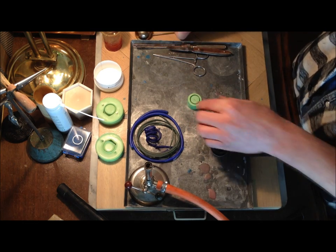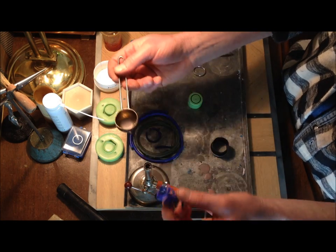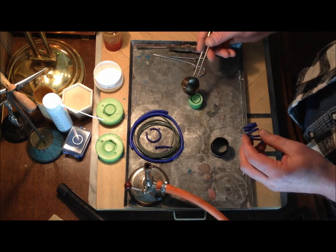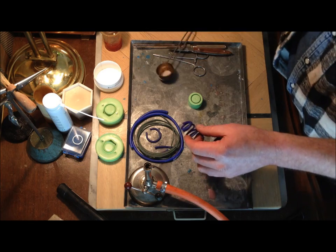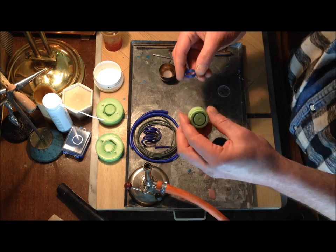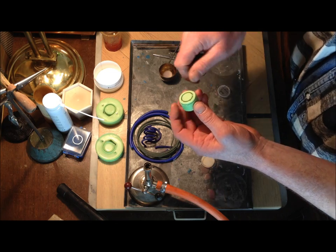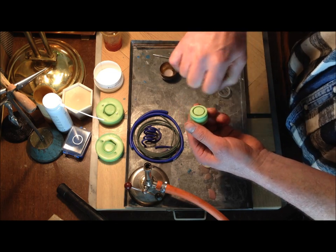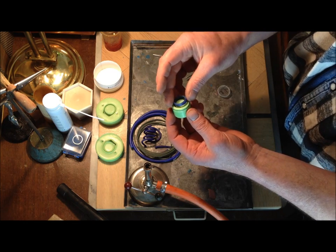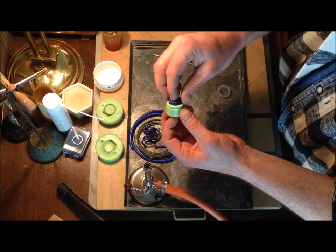At that point what you can do is melt a bit of wax — molding wax, it should be kind of a hard wax — on your Bunsen burner, and then you pour it in there. Once you pour it in there, let it harden. What I usually do is I put it in the freezer just a few minutes so it doesn't get too hard, but so you can scrape it and get it nice and clean. Then you've got to wait until it goes back up to room temperature, otherwise it's going to be too brittle and will break on you when you try to take it out.